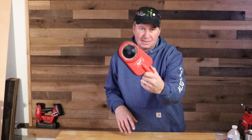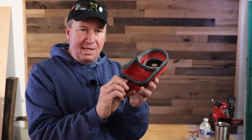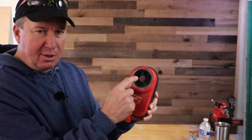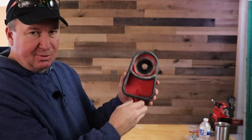I want to show you the setup I had 10 months ago when I did the drilling overhead in the concrete. The first thing is this — I believe it's called the dust shroud. It hooks up to your vacuum. If you have a HEPA vacuum, the hose end goes right there. This end creates a lot of suction next to a wall or up in a ceiling, and this area right here pulls the dust in through a little hole. This flexible material will flex with your drill bit — if you have a larger bit it will expand — and it helps encapsulate the dust and keep it within this shroud.